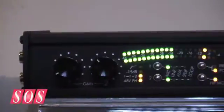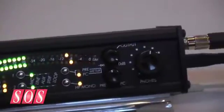This can be ideal for many applications, from sport to installation to many portable applications. It can also run as a standalone unit. To run in standalone mode, you still need a source of 5 volts — a 500 milliamp power source. A couple of batteries with a USB plug-on adapter could power this unit, giving you a portable mic preamp, A to D and D to A converter. It's a Swiss Army knife of conversion.